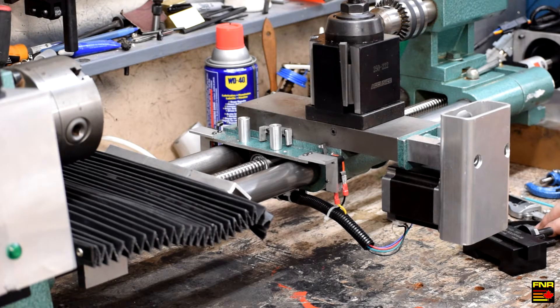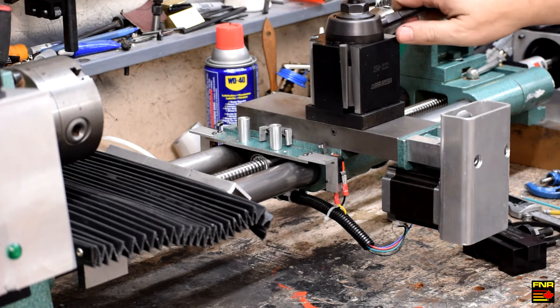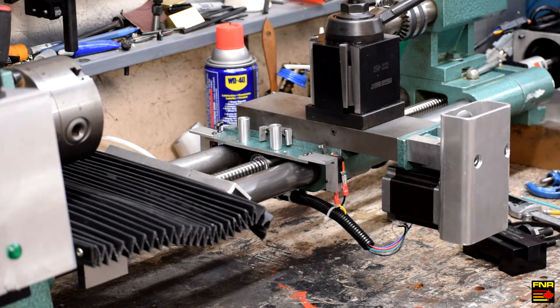We're pretty well done. The only part still missing is the index sensor on the spindle, so that we can get RPM-controlled feedback and an index point for threading — that's the only real major part left. Everything else is pretty well done. There's some tuning left to do, experimentation with depth of cut, and I've yet to try feeding it something from Fusion 360. But using it conversationally — just typing some G-code into it and off she goes — it works just fine.